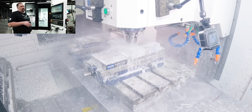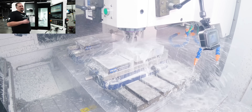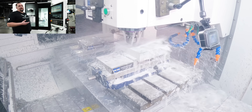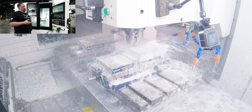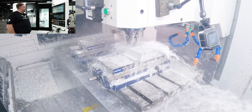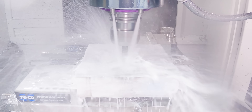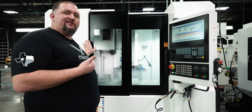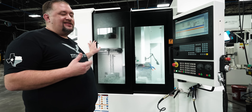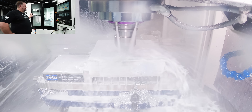I did decide to run this roughing using zigzag, so we're using conventional and climb cutting both with the same feed rate. I'm doing that because I know the tool can take it — I've run this at like 600 inches a minute before. It's doing as good as I expected; we're barely hitting 50 percent spindle load. Cut sounds great. It looks like we're making the X-Men symbol — if I was a Marvel character, I think I'd be the Broken Carbide Crusader.